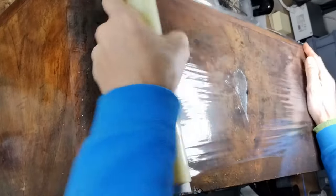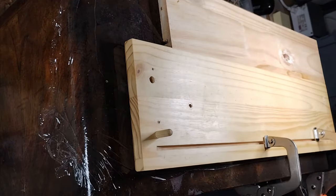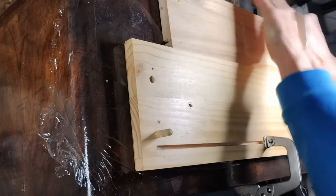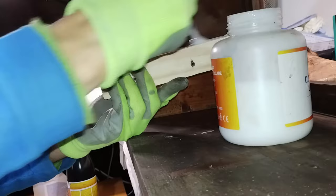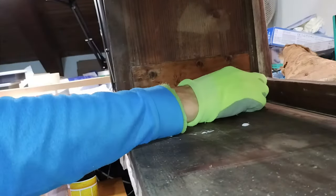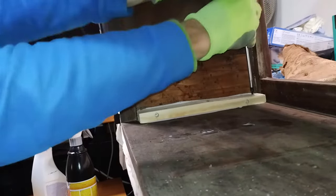The veneer is kept wet while pressing it with clamps in an attempt to straighten it. After a couple of days, the process will be repeated, but clamping on a dry veneer. Even though the panels have been connected using dovetail joints, it seems appropriate to strengthen the structure, putting small corner blocks where possible. These new wood elements will be useful also to hold a safety back panel, which the radio never had before.